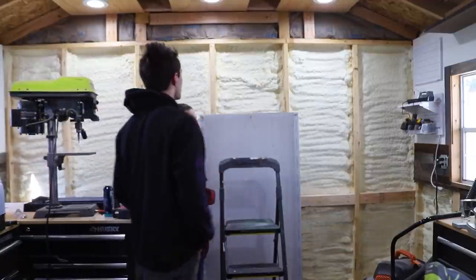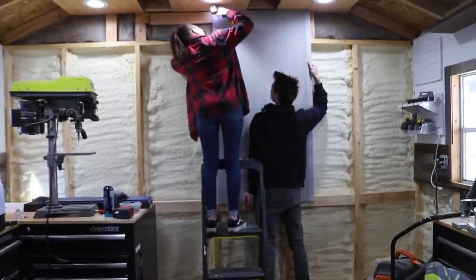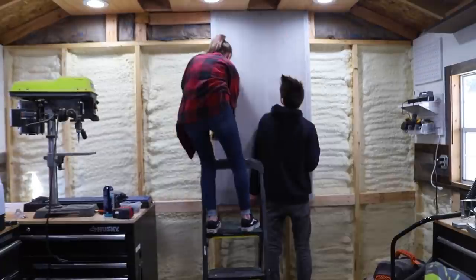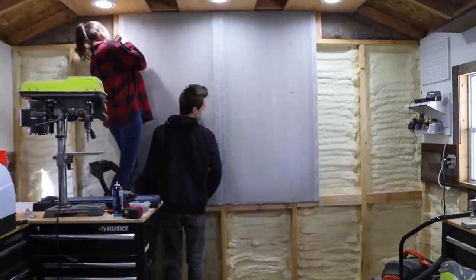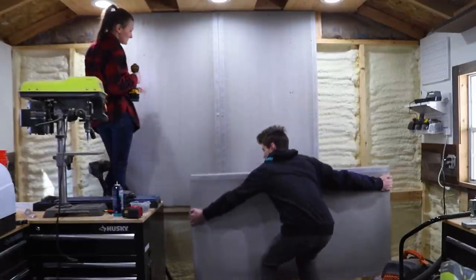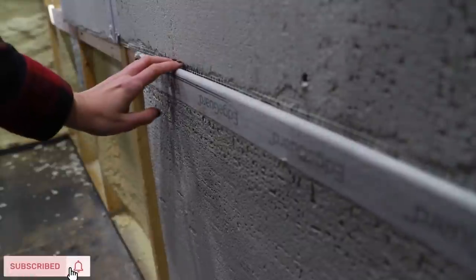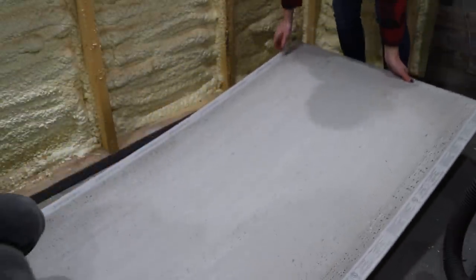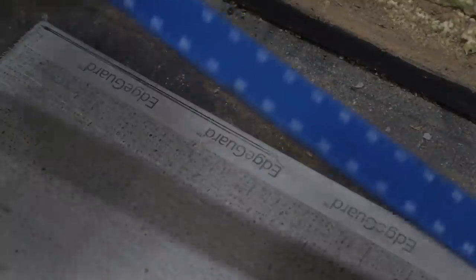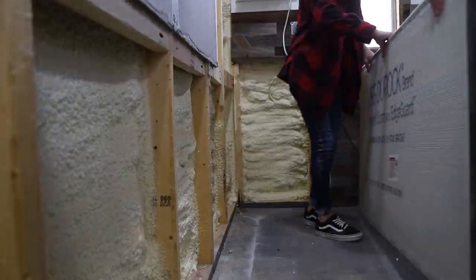Once the prep was done it was time to call in my brother to help with the cement board. I wanted to use cement board for this project instead of anything else because with all the vibrations of the tools I was worried that cement wouldn't adhere well to other materials. I've never done a cement wall before, but this is the way you'd do it around a fireplace, which felt like the sturdiest approach. If you're doing an accent wall like this at home, I'm not sure whether you'd need to remove the drywall or could just install cement board over it — if anybody knows, please leave a comment. Either way, the cement board was super easy to install and easy to trim.